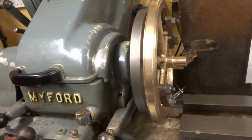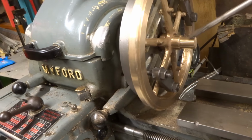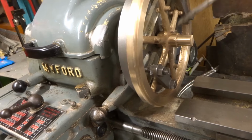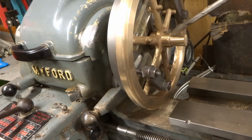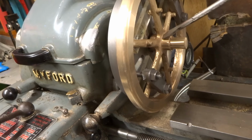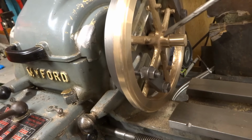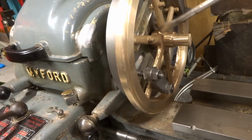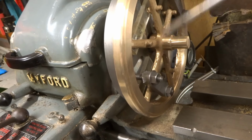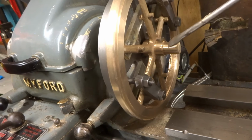That is the plan. The next step, I think I'll remove this boss, which doesn't really have any function, and bore and ream the centre of the flywheel 7/16, I think it is, and cut the slot for the keyway while it's all at this same setup. That way hopefully everything is sort of roughly where it wants to be,